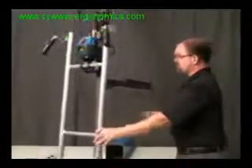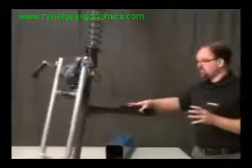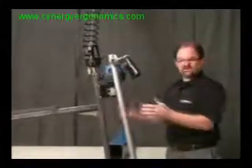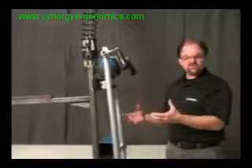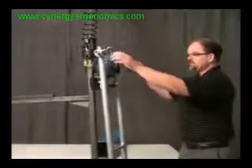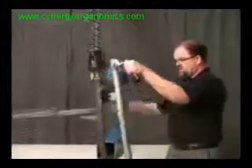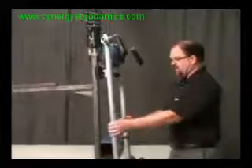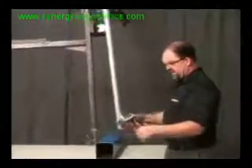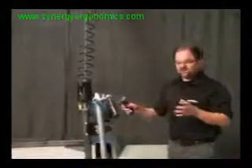This is not to be confused with float mode, because if I touch the part itself — the tooling frame itself — that doesn't move. But because we've got a pretty large area of tooling, the grips and the bars, it kind of feels like float mode to the operator, because pretty much anywhere the operator can grab within his reach will move up or down. We do have this incorporated with some of our soft touch handle bases, so you've got handles where I can reach high and low. Anywhere I touch on this will move up or down, whether I use one hand or two hands, so it's very versatile. High-low picks for the bottom grips and the top grips.